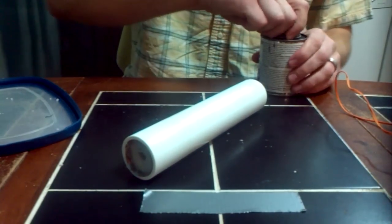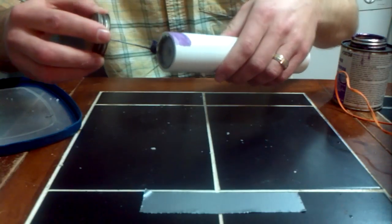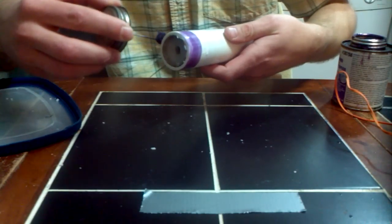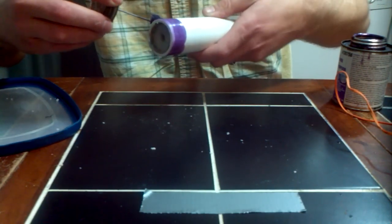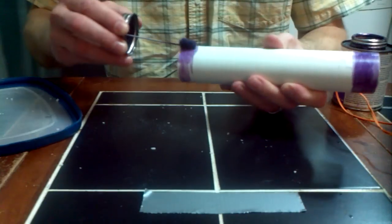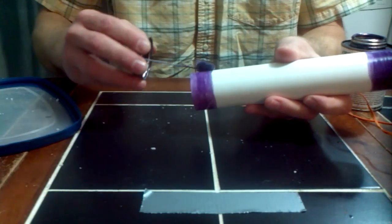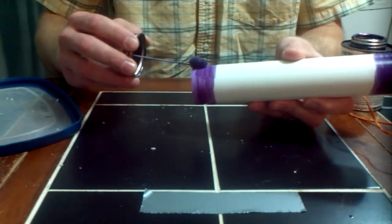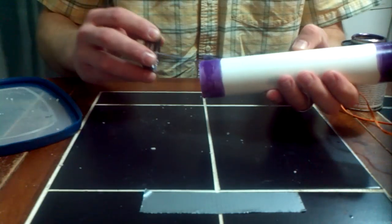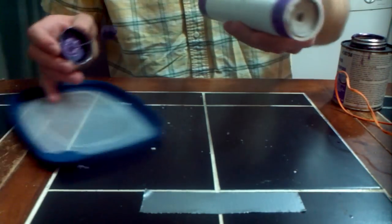So let's get our motor casing primed. How far down you go with the primer is really dictated by how much room you have left in your bulkhead, but you want at least every potential contact point coated with primer. This is a very simple but very essential part of this process — this is what's going to prepare the tube so the cement actually adheres and holds. Remember, this motor is going to have an internal pressure of 900 psi. We don't want this nozzle to come flying off — it is both very dangerous and presents a fire hazard if Bates grains start falling to the ground at 1,000 degrees.